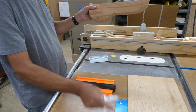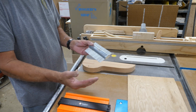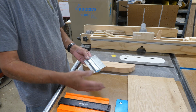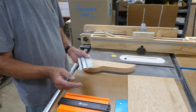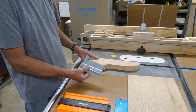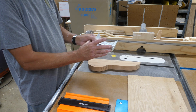Well, in the old time, with my old gauges, these are cheap. They're steel pins, and they're just a couple bucks. This one here happens to be Tool Shop, guaranteed forever, but hey, it's really the bargain bin thing. I have another one of these that's much larger that I used up at the renovation house. If you've watched any of those videos when I laid all the laminate floor, because I had a lot of door jambs to go around and hydronic heat pipes and etc. So the way you use one of these is you would take the contour gauge here and you would put it up against whatever you're trying to go around, and you push on it so it meets and you have a shape.